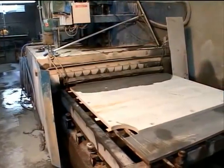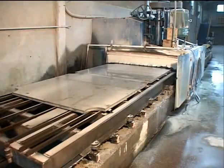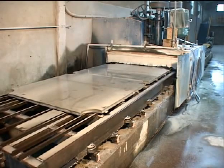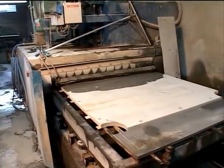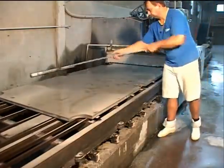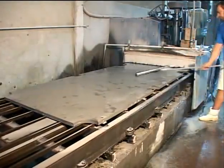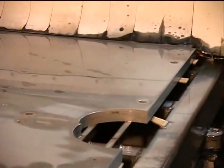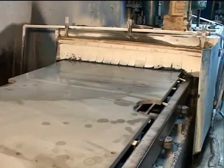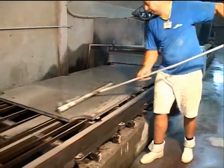The slate now goes through an additional surfacing process to give the slate its flatness. The BCA specifications allow the slate to be within thirty-one-thousandths of an inch, but Brunswick's slate is checked to be within ten-one-thousandths of an inch from edge to edge. The last surfacing machine is one of the most important steps in slate manufacturing. This machine has been custom fabricated to meet Brunswick's flatness requirements. Workers will surface the top and then the bottom. The speed that the slate is forced through the machine and the depth that it is surfaced is critically important. In addition, the surfacing discs must be in perfect balance in order for the slate to maintain flatness. A surfacing disc contains ninety-six diamond surfacing bits, and each bit costs ten dollars.